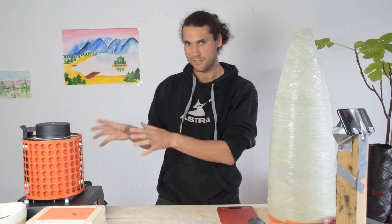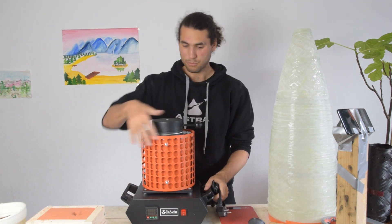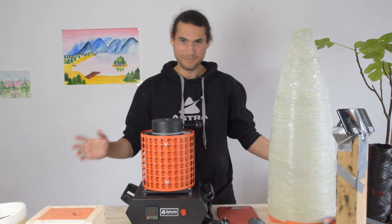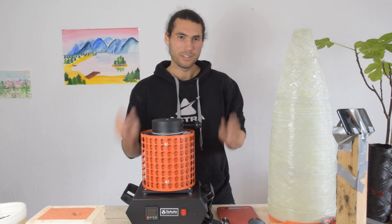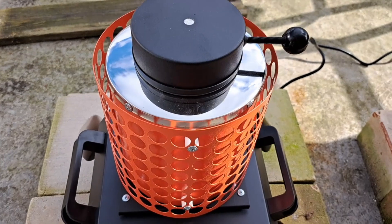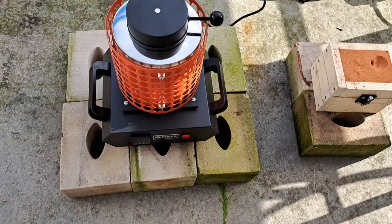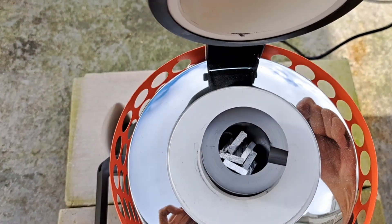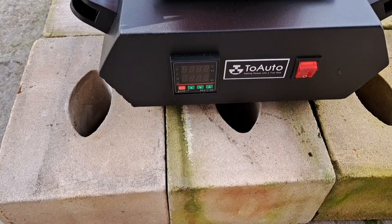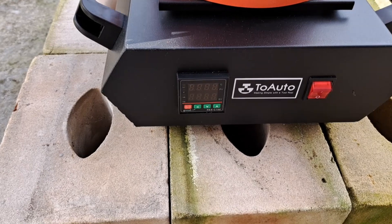This is a very important point — this is not an indoor toy. This furnace is capable of reaching temperatures of up to 1,100 degrees Celsius, so basically all the parts of it and everything inside is really, really hot, and if something touches it, it could combust. So we're going to go outside onto my balcony, where I have a bunch of concrete to put the furnace on so that we can do this in a proper way. We have concrete blocks set up for a little bit of safety. Now all we have to do is get this thing started. I'm going to start at 500 degrees Celsius and see if that's enough — if we need a little more we can crank up the temperature.